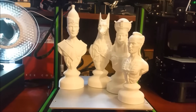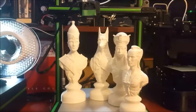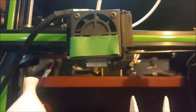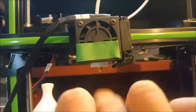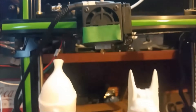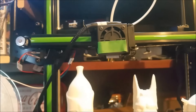And that goes for most any 3D printer kit — otherwise it's all user ability. I didn't do a whole lot to the printer. As you can see up here, I had to tape off the bottom of the fan because it has a hard time keeping up the temperature because of the type of heat sink in there. The bottom part of that fan is blowing right on the heater block. If I lower this and I'm not cooling it as much there, I'm now cooling it 100% with the shroud. And if I raise it so I'm not cooling with the shroud, I'm cooling the whole thing with the fan. So you've got to find a happy middle. I found my happy middle and I just put some tape up here to make sure everything stayed up to temperature. That seemed to work fine for me for now — just a quick fix.